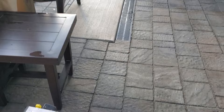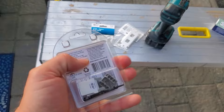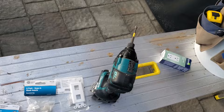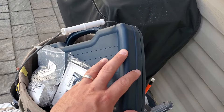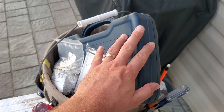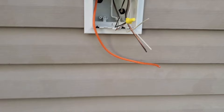We're going to use a Cat6 keystone here because we need a wire for the HDMI over Cat6 converter. I got a Cat6 keystone jack — I couldn't find a single keystone plate so I had to get a dual, and that meant getting a couple of blank covers. That'll give us an extra spot if we ever want to put something else in. We'll get those wired in, and I'll get this Cat6 terminated. If you don't have a termination kit for RJ45, get yourself one — they're cheap and they come in handy. It comes with the terminations, the wire stripper specific for that, and a crimper for both RJ45 and your standard telephone connection.